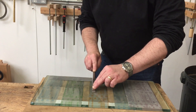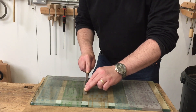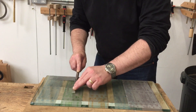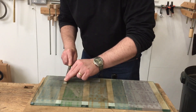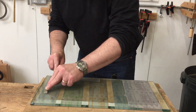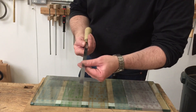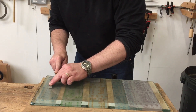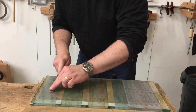I'm going to start by doing short strokes. I'm using this dry because it's more aggressive when dry — the film won't last as long, but we're looking for material removal at the maximum rate because you've got a big chisel to prepare. I'm just going to let these strokes gradually increase in length as we go up the blade, working from one end to the other, until the tip just drifts on. That's one set — you can see how much metal that's taking off, so it gets you there pretty quickly. Once you get to this end, turn around and go back the other way.